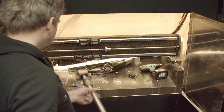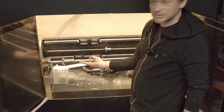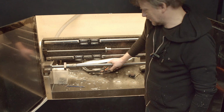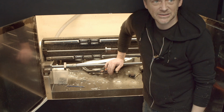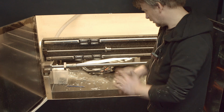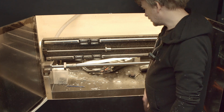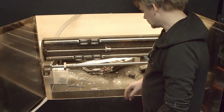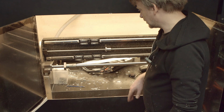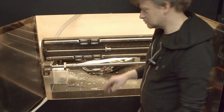That's why now I will be using this one. So as you can see, that's a considerable upgrade, and that one doesn't seem to be moving much. That's why, in my opinion, you shouldn't be using size 16 at all in CNC machines, even the wooden ones, really. That's too much flex. Go to like 20, I think 20 for CNC is the minimum on that length, on the meter. Maybe on something shorter like the Z, 16 is fine, but for a meter, nah.